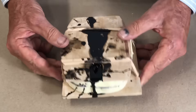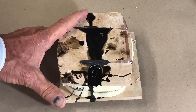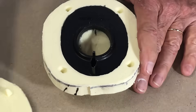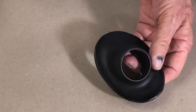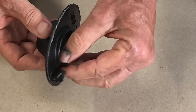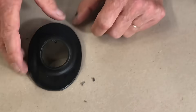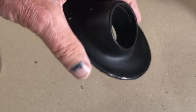I just took this out of the pressure tank and we're ready to unveil it to see whether all our work was worth it. I put down new paper for the unveiling so it'll be nice and clean. That came out very nice. We'll just trim these things off, but it's a nice rubber mold — it's not really rubber, it's urethane, but it looks just like rubber. So there you have a 1936 to 39 Lincoln Zephyr firewall and steering column boot. I am very pleased with this. Thank you for watching.